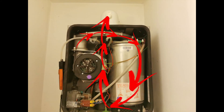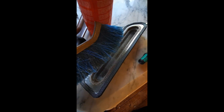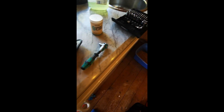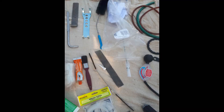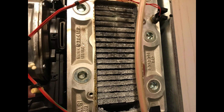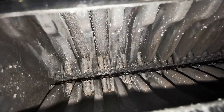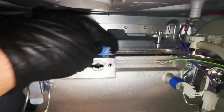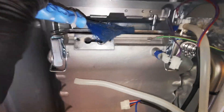Referring to that flow chart — going from the burner arm into the heat exchanger, check the burner cup first and make sure it's nice and clear. Use a soft bristle brush, shine your torch on it. On the Worcesters you should be able to see daylight; use an air duster or compressor if necessary. Worcester offer cleaning kits with brushes for the heat exchangers — I'll do screenshots of part numbers. I've also got videos on how to clean all these heat exchangers. If you're still getting a bad reading, check the sump for any blockage.